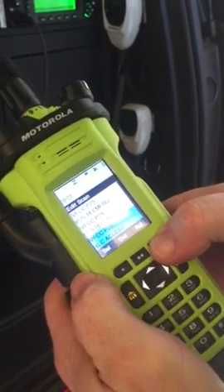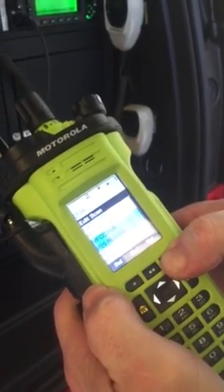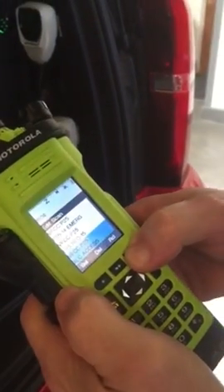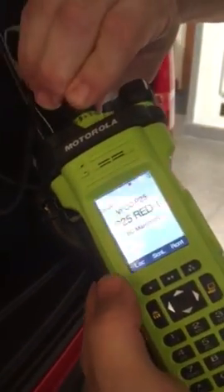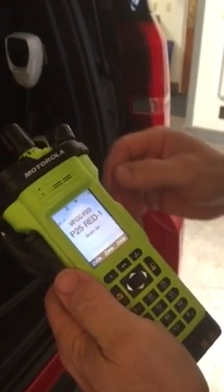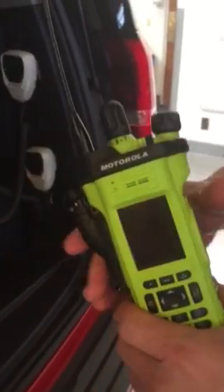Check it by hitting the recall button: 9, 10, 14 with the second priority, and 16. Hit home zone once to get out of it. Back to red one, P25 red one. Scan on. Radio off. And that's how you update your scan lists on the trunked and conventional side after a radio programming.